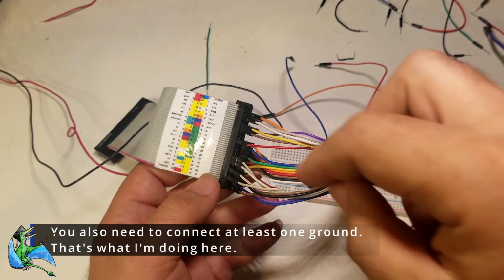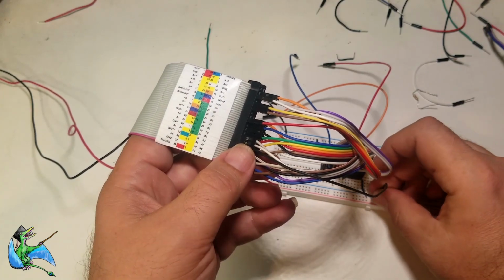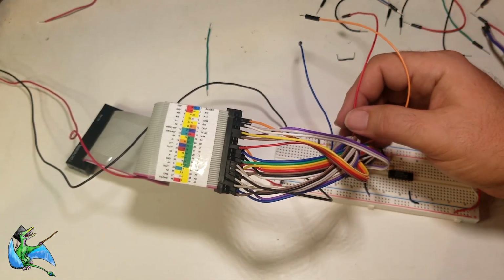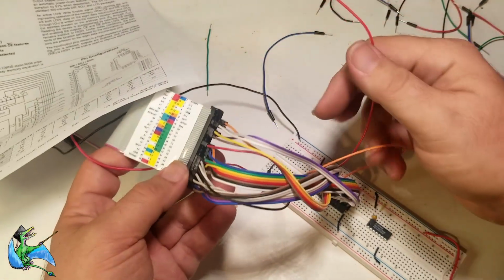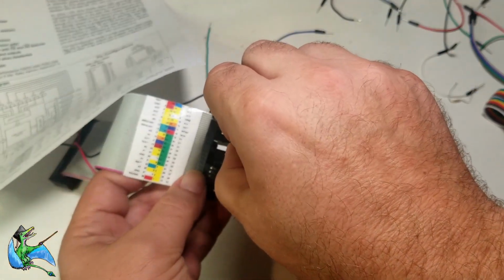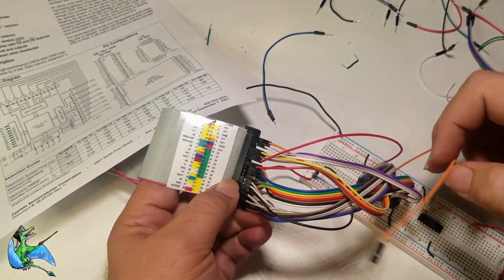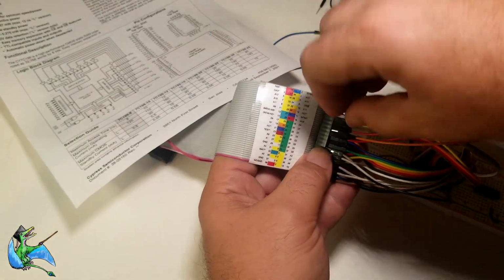After all the address lines up to A14 are in place, you can then connect the write enable and output enable signals on the chip to memory write and memory read on the TRS-80 bus. The signaling the TRS-80 provides are directly compatible with this chip. All that remains is the chip enable signal, which is used to tell the memory chip that the computer would specifically like to read or write to it in particular.